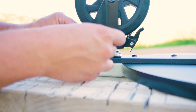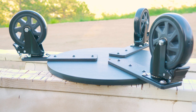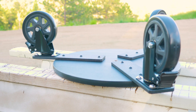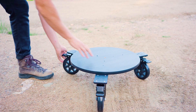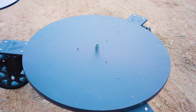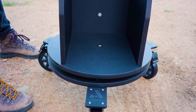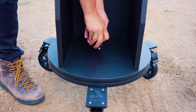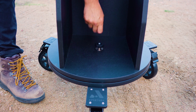When this process is finished, your AD8 base should look like this. Now this is the last step — we're going to reassemble the entire base. Flip the board around and make sure you lock the wheels down so it doesn't roll away. Insert the axle sleeve into the center hole and then install the roller bearing assembly. Now place the rest of the base onto the ground board and secure the assembly with the tension knob hardware. At this point, we should be finished installing the entire Roll Easy Kit.